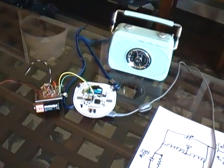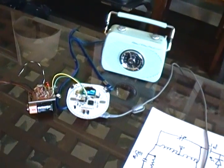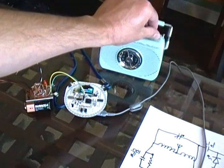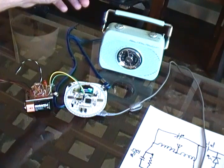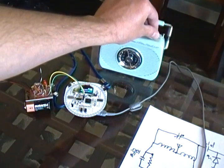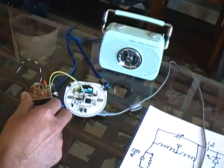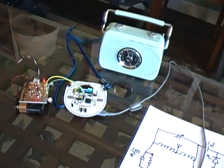Let's see this little thing in operation, if my camera doesn't fall off the tripod. So we have your little FM radio — you pick your radio station of choice. This works in the kind of mid-VHF range, about 95 to 105 megahertz. So we have music. We connect power, and we have an obnoxious racket that we can control with the PC software.